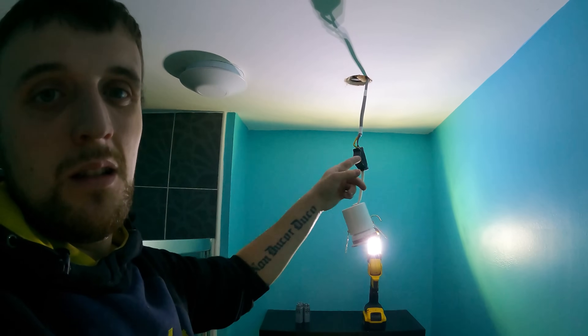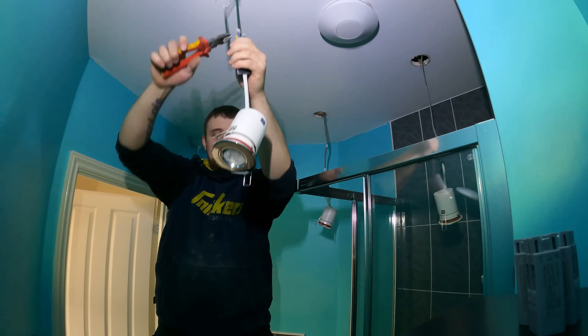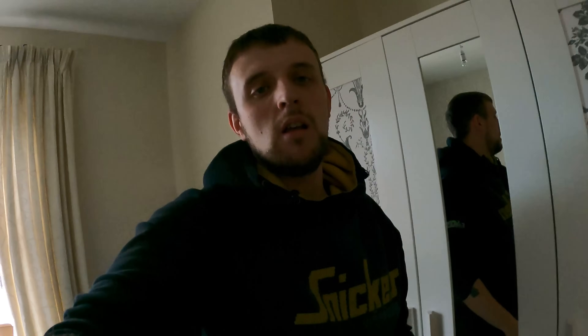If you do use that kind of light where it needs just a flex, them Quick Wire connectors are absolutely bang on — can't fault them at all. EICR remedials like this, because this is quite a common problem — doing loads of EICRs at the minute — this is a brilliant way to fix that. That's the first bathroom done — four lights, took about 25 minutes, but I was filming and taking photographs of the connectors. At a nice steady pace it'd probably take me about three minutes each — maybe two minutes if you bought the pre-made leads. Which is pretty good.